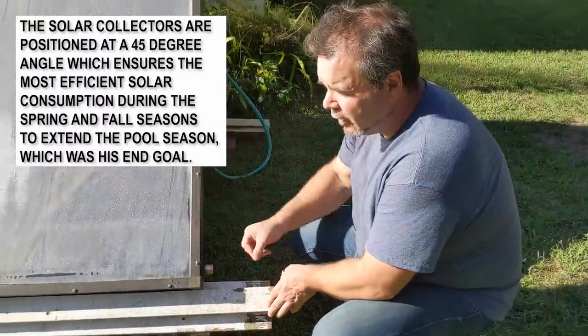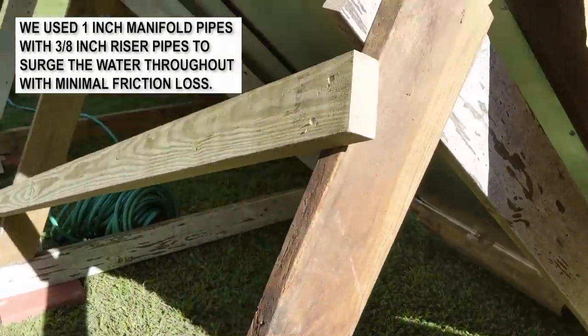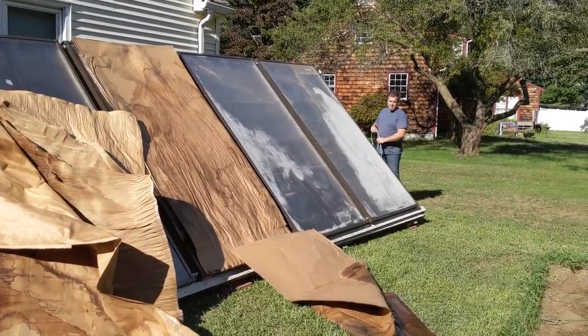It gives you the slope — if you're somebody like me who didn't really understand how the panels worked, I thought there was some sneaky thing, but instead it's a solid pipe at the bottom. When you cap it, it forces all the tubes to fill up and then squirt out the top because of the other cap on the other end. Once you stop, it all drains down the tubes to the bottom tube, and the bottom tube is tilted with the shelf and shoots out that end.